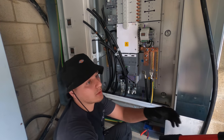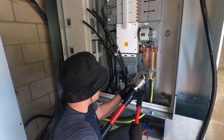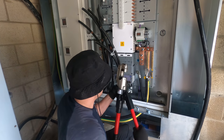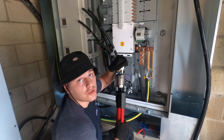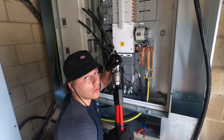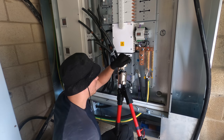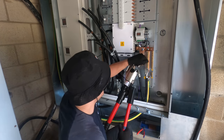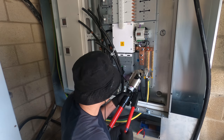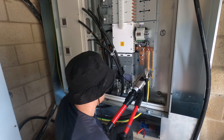Why did you put that line through the cable and the crimper? So that you know where it's sitting, because if you don't, then it might be sitting in completely the wrong rotation. And then you've got to try and twist it, and you're messing with the compression that you've done. And you can twist them, like if you put a screwdriver to it.